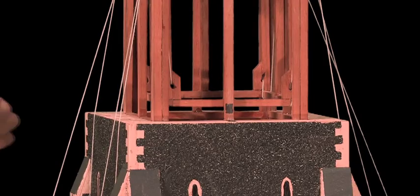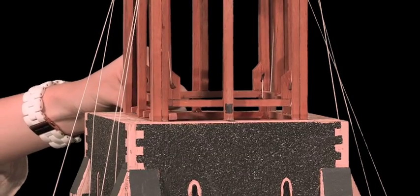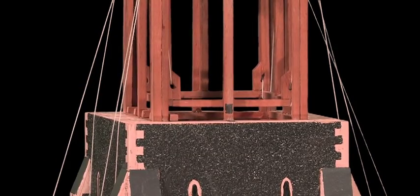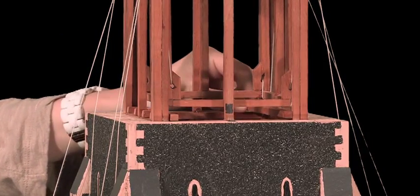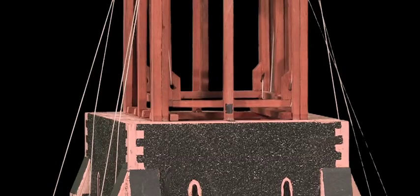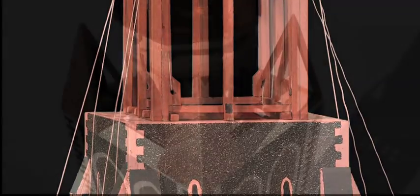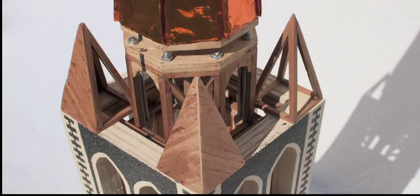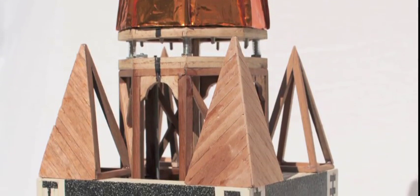Of necessity, the wooden sections have to fit inside the stone base. This results in a stepping in of the silhouette where the timber frame structure extends past the stone base. The design was developed specifically to allow the silhouette of the original tower to be duplicated. That requires the bell level facade to be built out to the width of the base. That could be done in lighter wooden construction at the time of the raising of the steeple, or in stone as time and money permit. Either way, the steeple would be flexible and structurally independent.